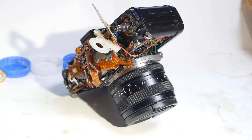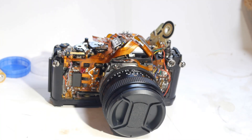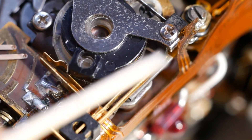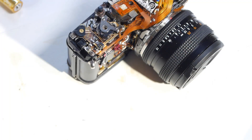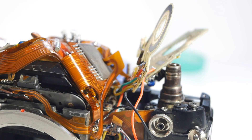Not really expecting anything to happen, I again wasn't filming this bit, but when I turned the camera on nothing happened — until I noticed some of the magic smoke escaping from somewhere around here. At this stage I figured that the whole project was now dead and buried, so I sat the camera the correct way up and cautiously turned it on again to see if I could figure out what was getting hot. Nothing was obvious, so I turned it off again, and next time I tried the switch, the moving contact had welded itself to the clear plastic of the shutter button switch. This is consistent with where I thought the smoke came from, so clearly when the camera powers up something is going to a dead short. I suspect this was what was happening before when it kept dumping all the voltage out of the batteries — at that time I was using tired old batteries, but I'd swapped to a fresh set, which is probably why I created smoke this time round.